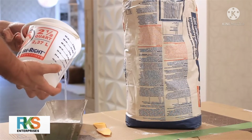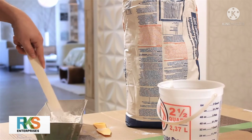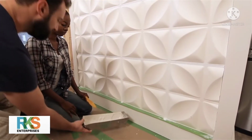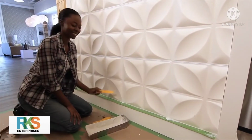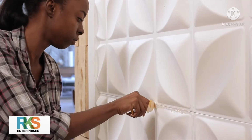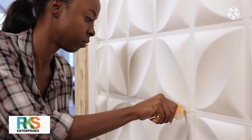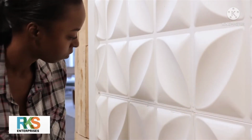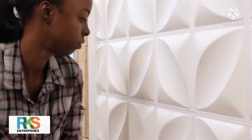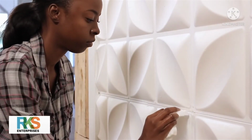Most tiles are designed in a manner that the design elements and spacing look to minimize joint appearance without additional finishing work. If you space the tiles when adhering, the gaps need to be filled with sheetrock, Easy Sand 45, or sheetrock Durabond joint compound. Typically this requires 2 coats. The first coat will be mostly for filling the gaps. Keep it clean to avoid excess sanding later.